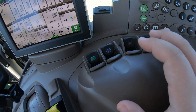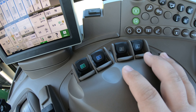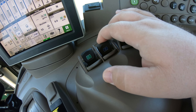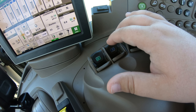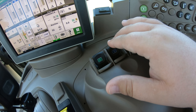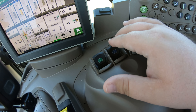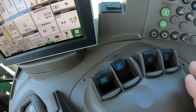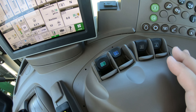The first thing we need to talk about are our switches. These are going to be five-position switches, meaning they have five different functions. You can pull back on one, you can push forward on it — that makes two functions. When you pull back you can make it click, that is going to be the third function, or you can push forward and make it click and that's going to be your fourth function. Or we can push forward even harder to where it stays down and this is going to put that into float mode.